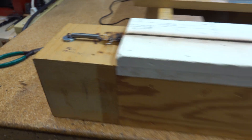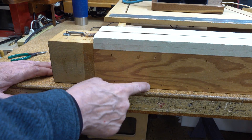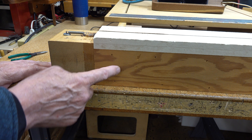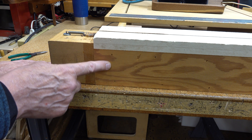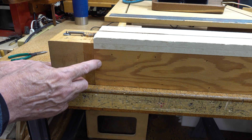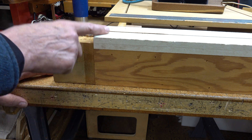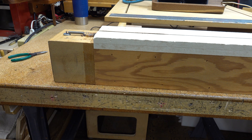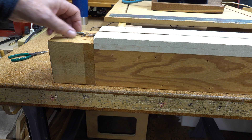When you build the box, don't make it a perfect sealed box all the way around. There's a bottom and top as you can see by the nail holes — it's just a long box. You really want to move the top inner layer down so there's a channel underneath the heating strip. If you make a perfect box you'll open it up and find it's burning the wood inside. Move that layer down a little — my nail holes should have been along the side, but you don't learn that until after you've made your first heater.